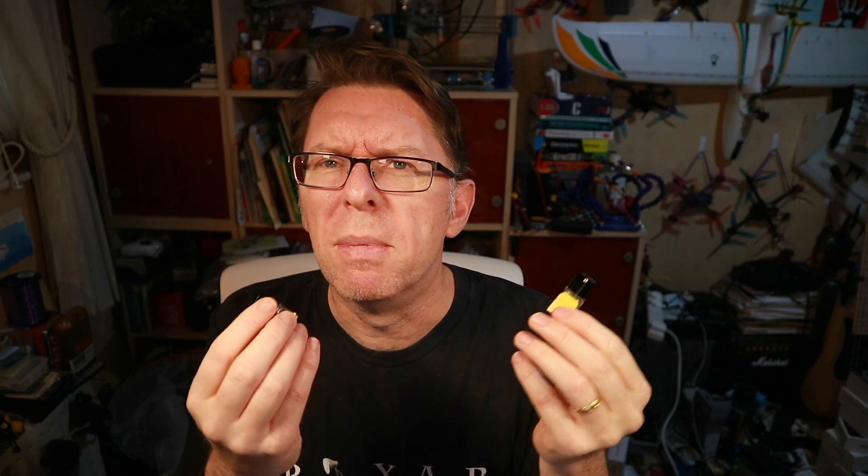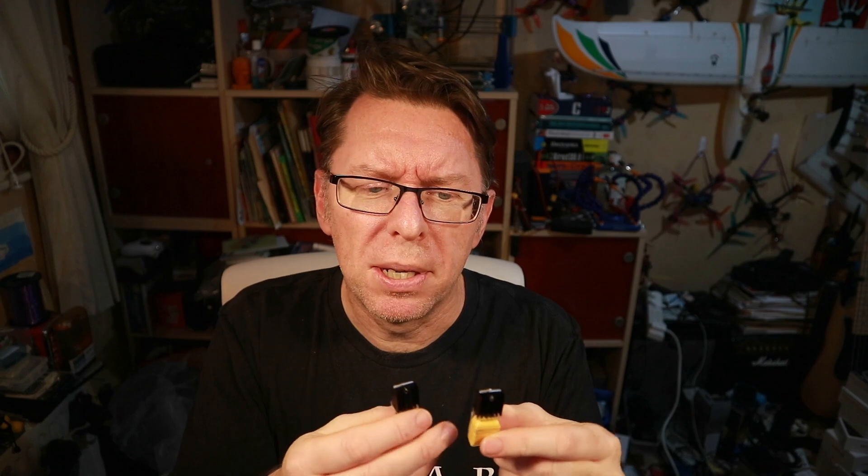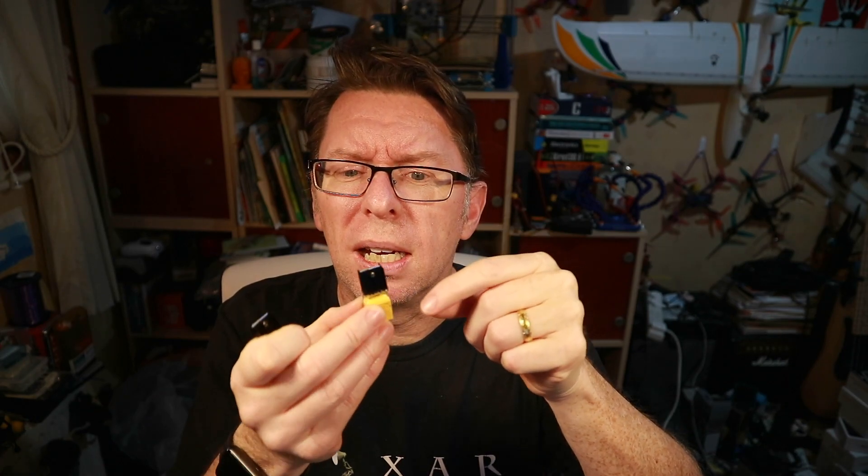So I figure you might have a bunch of these, start taking any unused batteries to storage, and then perhaps finish it off with a regular charger to make sure they're balanced. I don't know yet — I'm going to go to a close-up, let's plug in a few batteries, see exactly what happens, and then check out exactly what sort of charge they're doing. Because we won't be using the balance lead at all, I can plug in something to read the voltage as it discharges, which might be interesting.